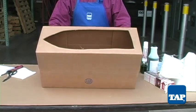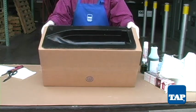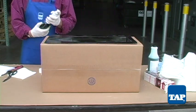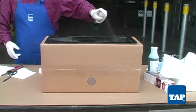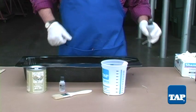To more easily support the mold, we have cut out a matching hole in a cardboard box. Now we are ready to apply the PVA to the mold. In the same way we did with the original part, spray a light film with the PVA sprayer, followed by another light film. Allow it to dry completely.